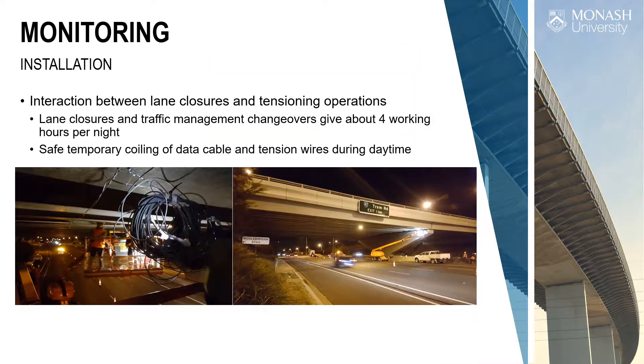The main problems on this bridge were traffic management. The motorway is so busy that health and safety rules around proximity to live traffic are very strict. Setting up and taking down the traffic management takes about an hour each way. With possession from 8 PM to 5 AM, you lose an hour at the start — not beginning work until 9 PM — and have to leave by 4 AM. This made everything intensely pressured.